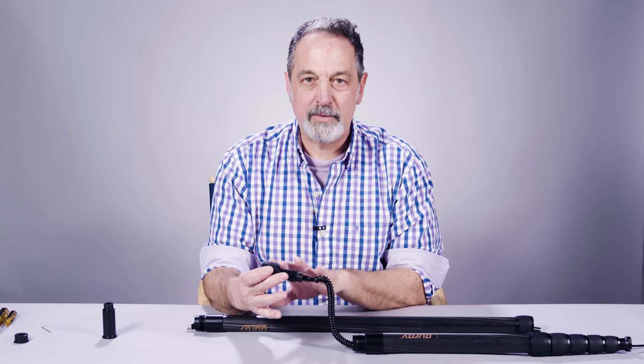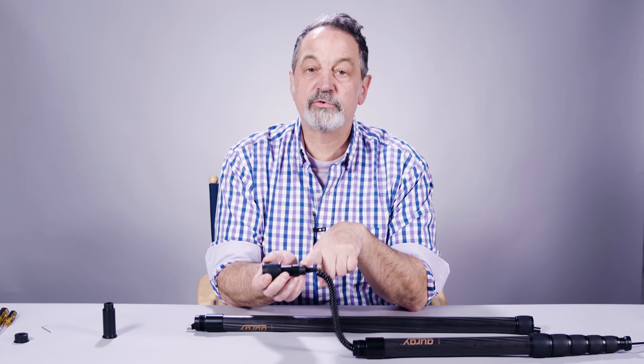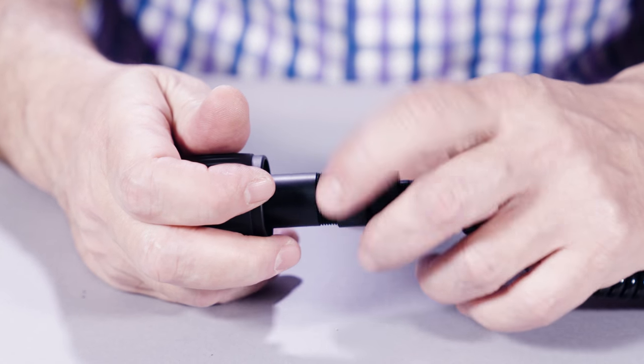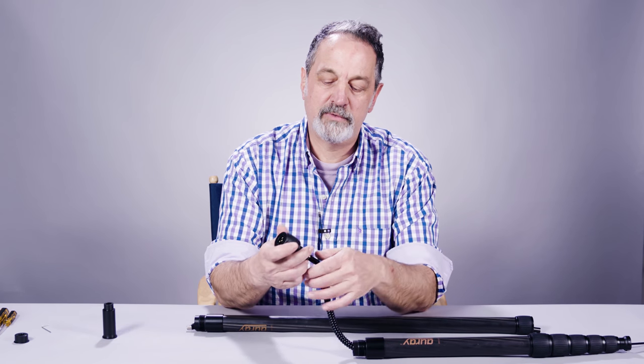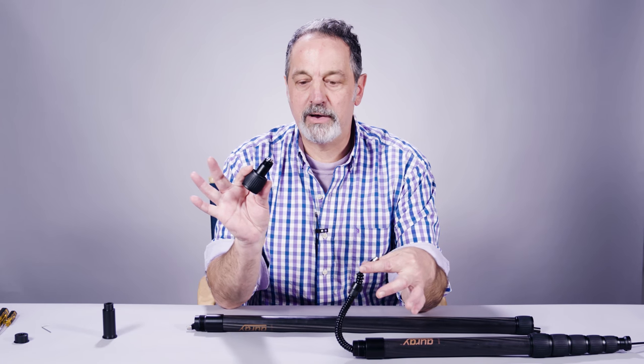The configuration is a little different on the bottom exit. The bottom exit has a screw-on strain relief. So the first thing you're going to do is unscrew it after you've given yourself all your proper slack. Unscrew that, bring it down a little bit just to give yourself some room, depress the tab, and take out your bottom exit.